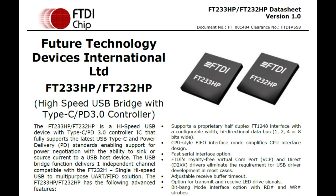What does the 'P' stand for? The P stands for power delivery. The FT232H has now been upgraded to add USB 3.0 Type-C power delivery specification support. It's still a high-speed USB device, but it has added the CC1 and CC2 pins used to request higher voltages and higher currents from a USB port — really useful if you need more than 5 watts or 5 volts of power.